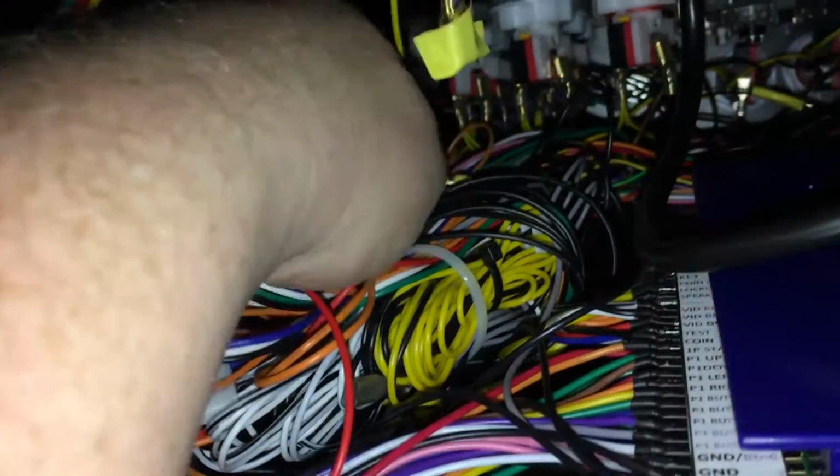Now, I want to point out a couple of things. You notice how even for these wires, like this one, that have clips, I still chose to cover them in tape. It's a good idea. Electrical tape helps guarantee that if these touch, it won't destroy everything, but since these are wired to my lights, all my lights would flicker. The speakers I had to purchase, but these you can get for a decent price. I also used a cold cathode tube out of a PC to do the surface lighting or the backlighting for the marquee.